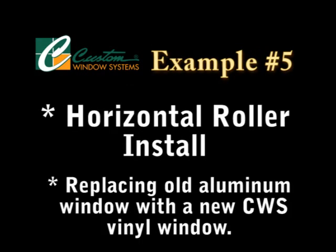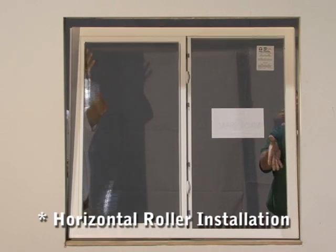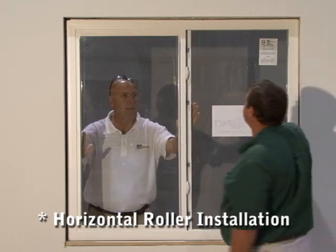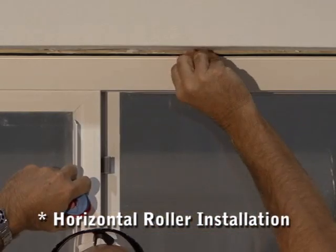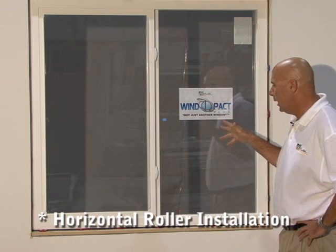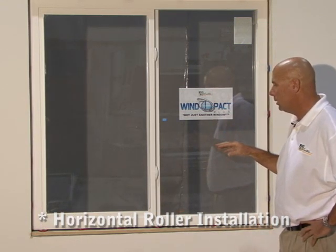Okay, now what we're showing is our horizontal roller from the inside. The installation from the outside is exactly the same as the single hung windows. You dry fit your window, you measure openings, you check for no damage on the windows. Once you install it, we've come to the inside. We've got our structural shims installed all the way around the perimeter. There are some additional features and changes to this window on the installation that are different on the horizontal slider.